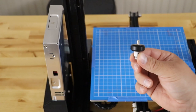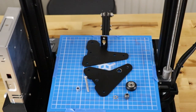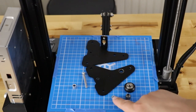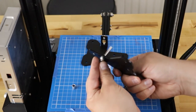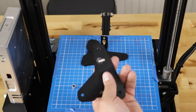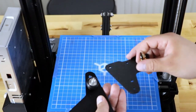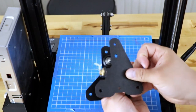Now we're going to put this carriage back together. Start by putting the eccentric nut and wheel back on using one of the longer bolts from the kit, one of the spacers from the kit, the existing eccentric nut, the wheel, and the washer. Put the washer on the bolt, then push the bolt into the back side so it looks like a J — that's how we need it. The eccentric nut goes in next with the flange side in, then your wheel, then a spacer, and then take the other gantry plate and put it in the second hole down just like on the first one.